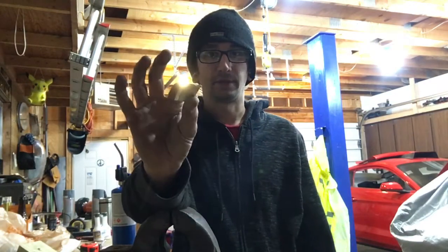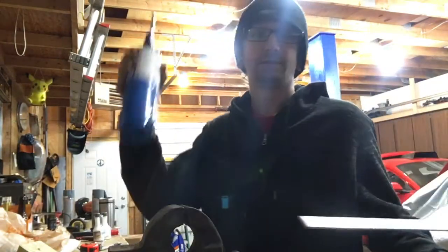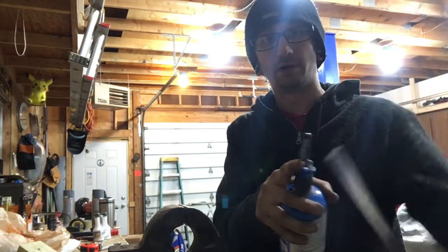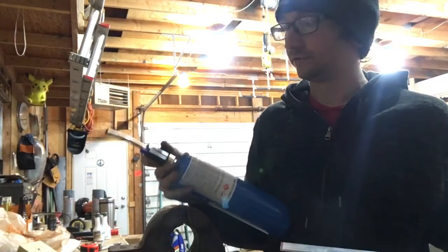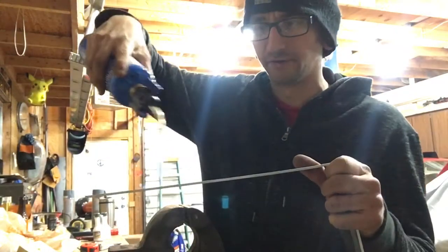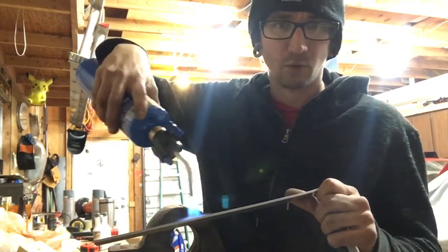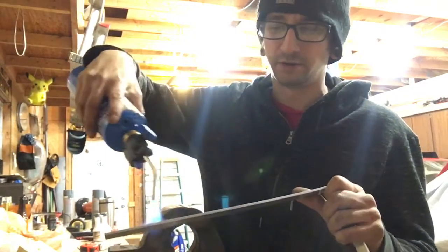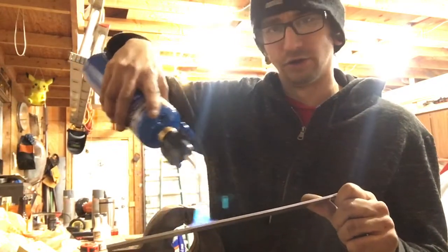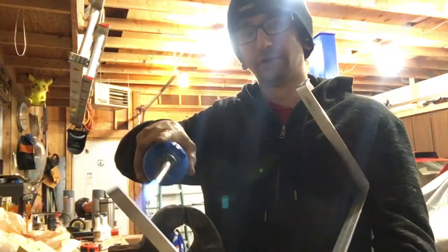So how do you prevent that from happening? A blowtorch — something as simple as a blowtorch. I have this scribed out where I want to bend it right there, so I'll just turn the gas on and basically just hold it over where you want to bend it for about 30 to 40 seconds. Make sure to get each side, and you'll be able to tell when it's almost ready — the metal will get a little bit shinier, it'll burn all the coatings and that off it. When it's ready to bend, keep it up, flip it over and get the other side.